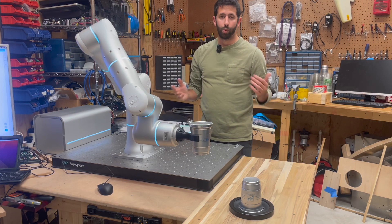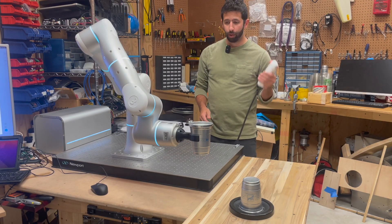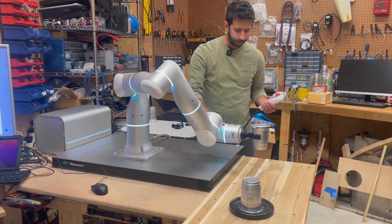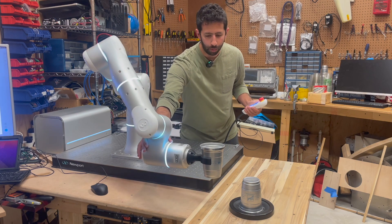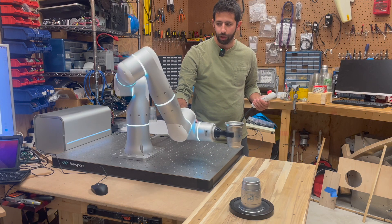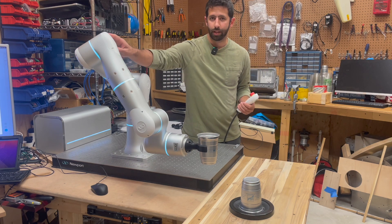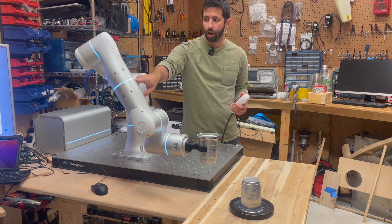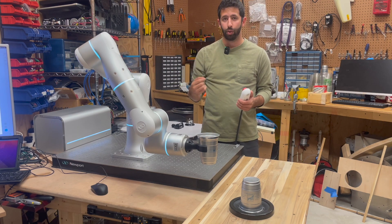Watch as I reorient before I go to get the drink over here, such that the joint is now facing that way. Why did I do that? When the joints were in the other direction, that wasn't possible — I was hitting joint limits, specifically on joint 5. So let me go ahead and turn null space on and reorient the arm to show you what I mean.